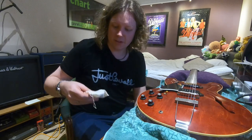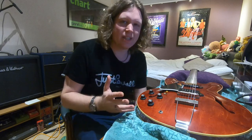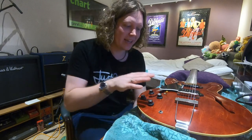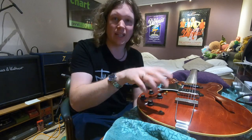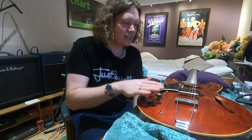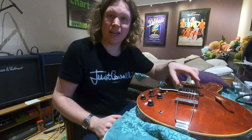So today I'm going to be giving this guitar a new set of pots — these are them here, the vintage inspired pots, the VI pots as their name. As anybody who's ever even thought about rewiring a thinline guitar will know, getting the electronics in and out of one of these is an absolute nightmare, because unlike a Les Paul where you just pop the control cavity open at the back and throw the pots in, with these you have to thread all the electronics pre-wired down through either the f-hole, if they will fit, or the pickup cavity.